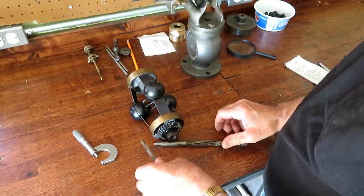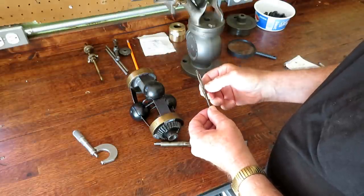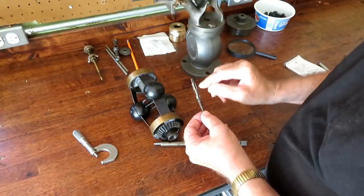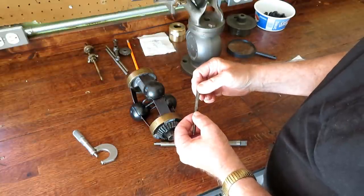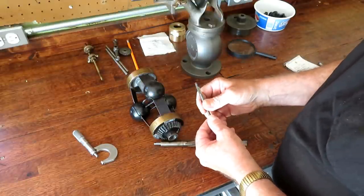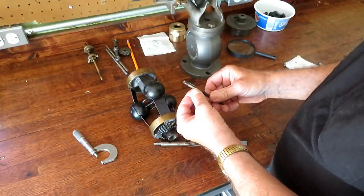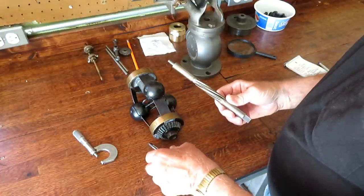The ones you get are adjustable reamers of this style, and they have grooves cut in the threaded part that are tapered, smaller on this end and shallower on this end, and these blades move back and forth with these stop nuts. So you have to back off on one and tighten the other. And I don't think they work as well. They kind of tend to hog in on soft material like Babbitt or bronze. I mean, they work, but I think these work better.